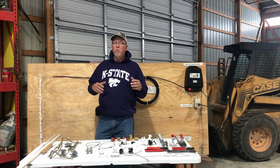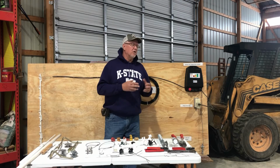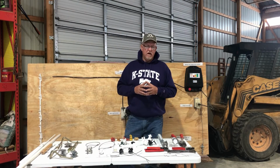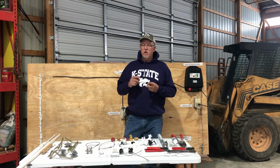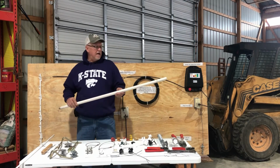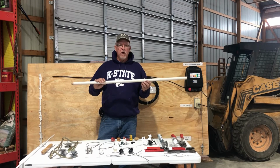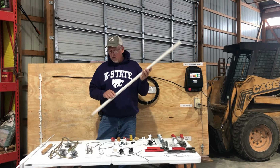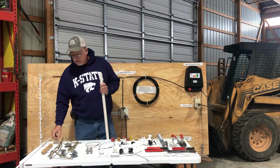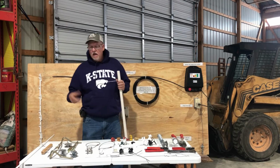So we've talked about the kind of wire to use. Let's talk a little bit about post. Fence post, we can use everything from a steel T-post to a hedge post, and they make other posts. Here's actually a plastic post. It's plastic and wood composite. You have to make a pilot hole. You drive it in the ground. You drill a hole here. You put the wire up. You put this clip over, and you stick it in.